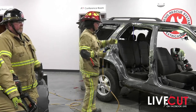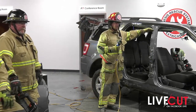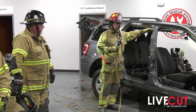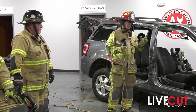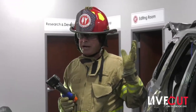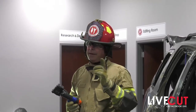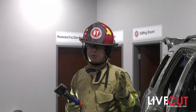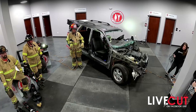Question: how do you deal with the cutter walking in if you don't have a New York hook? That's really simple — buy a New York hook. It doesn't have to be an actual New York hook but it has to be made of steel. They're cheap, about 150 bucks, and it doesn't matter who you buy them from. Having that New York hook will really save your bacon. Again, this is with a Genesis tool — I'm not telling you to use this with any other manufacturer's tool, but this is something you can do with ours.